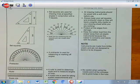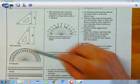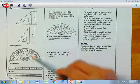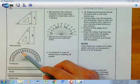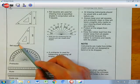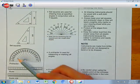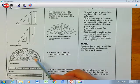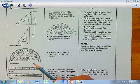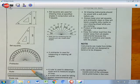Okay, then we're moving on to the protractor. Any of the angles that don't appear on your set squares, we need to use this particular equipment. Any angle in between 60 and 30 and in between 45, for example 55, 50, 110, we use this angle ruler, which is called the protractor, to mark it and draw it, right? And then we have two types of rulers, a scale ruler and a normal ruler. It doesn't really matter because we can scale it down without using a scale ruler. But it's good to have a ruler for measuring purposes.